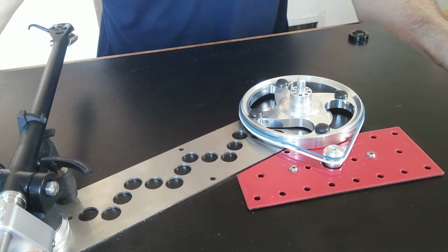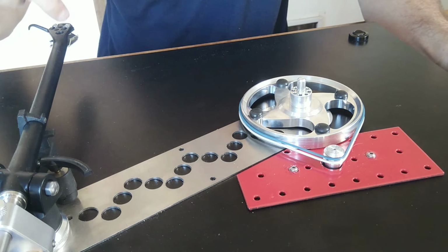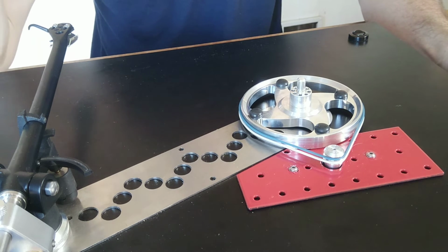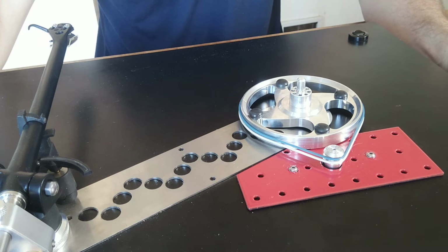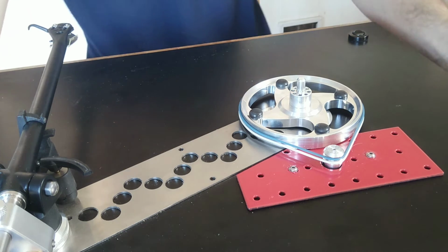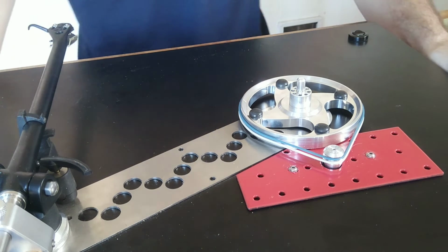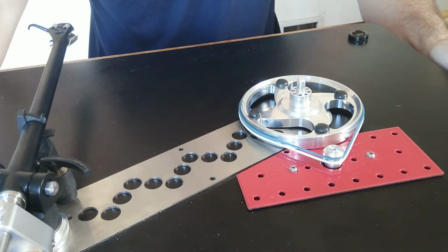And then finally, on the arm, I've changed the internal wiring. I had already changed this for oxygen-free copper Litz cable. Litz is usually the gold standard. It's very flexible, very fine, produces a nice sound. But I wasn't happy with the result, particularly where it joins the cartridge body. So I thought I'd move to silver because it's actually not a lot of money.